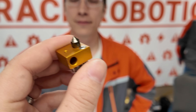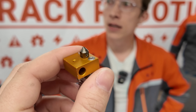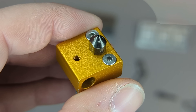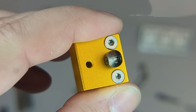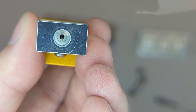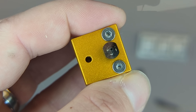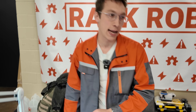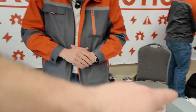You can do some pretty crazy accurate stuff. This nozzle right here has a star cut into it — that was done with wire EDM. We took the nozzle, put it in a vice, moved the wire over, threaded it through, maintained an offset, found the center of the nozzle, and then ran a G-code to get a star shape in there. This specifically is a hardened steel nozzle, and we were able to cut that out with that accuracy in hardened steel.